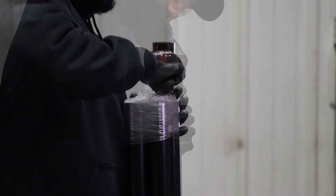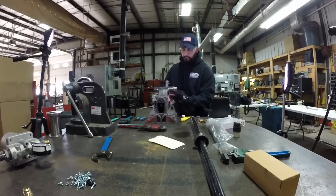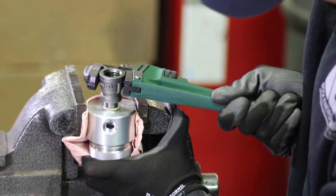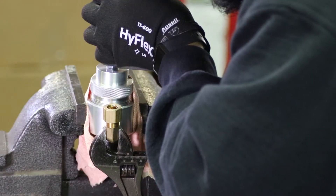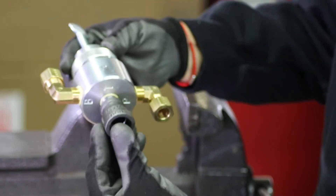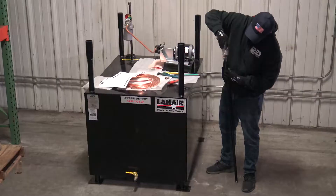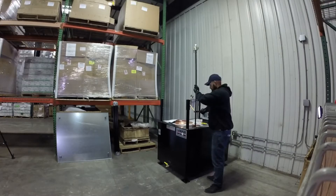Locate the fuel return pipe packed in one of the tank stand legs. Using a vise, preassemble the oil pressure bypass regulator, which is comprised of the regulator assembly, a threaded nipple, the return pipe adapter, an intake compression fitting elbow, and an output compression fitting elbow. Orient the elbows so that the pump side elbow will be pointed downward and the burner side elbow will be pointed upward when the assembly is in its installed position. Attach the oil pressure bypass regulator assembly to the return pipe and install the assembly to the small bung on the top of the tank.